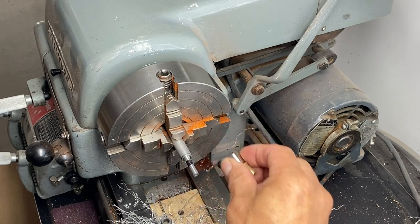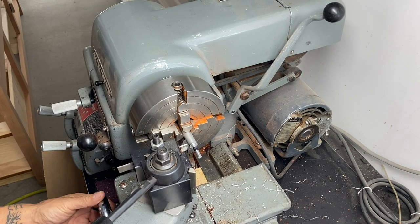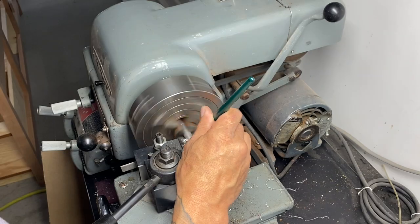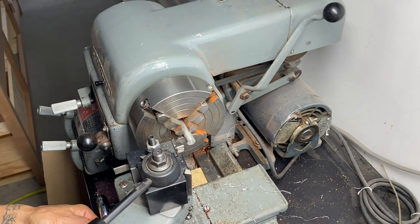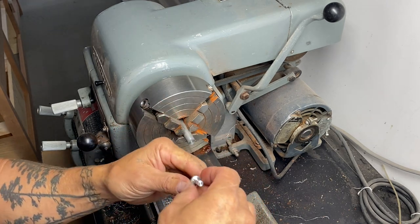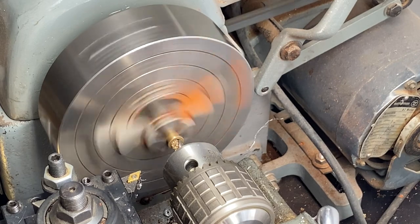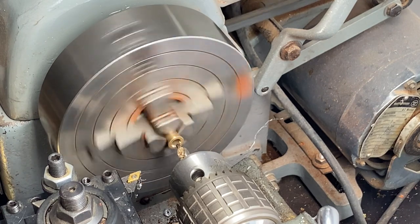Pretty simple, should work. If you want to make a latch like this, don't use a bolt — the metal around it will just act weird. You could use some non-ferrous metal, just quarter inch, and slip a barrel magnet right over it — brass, aluminum, something like that. It doesn't really need a flange on the end. It could just be some quarter inch round bar with a barrel magnet epoxied in place on one end. The latch is kind of like a sliding deadbolt.